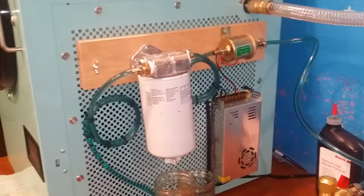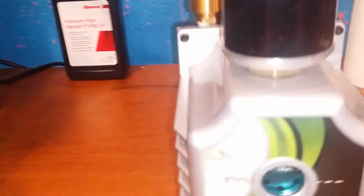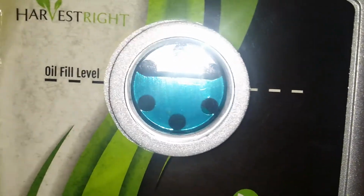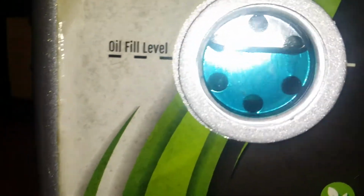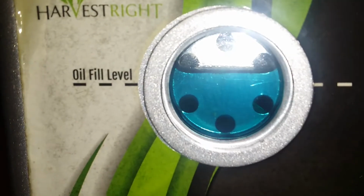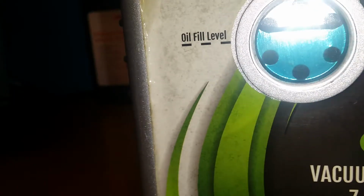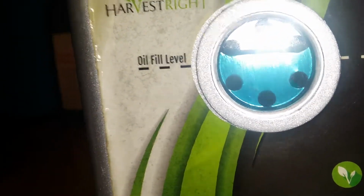A lot of moisture. You saw the water and air bubbles that were appearing here in the eyes. You can see, because now that it's finished and it has been cycling, let me get it to focus, that there's no air bubbles in there at all. I can turn the pump on, and you can see how it's just perfectly brand new clear oil, because there's no more water being introduced into the oil, so it really purifies it and filters it just the way it should be.